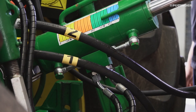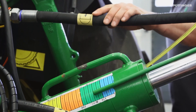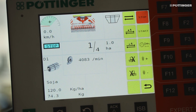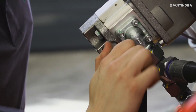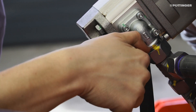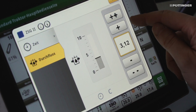To drive an Aerosem seed drill equipped with PCS, an additional control unit for driving the separation elements is required in addition to the fan. The fan speed is set to 4000 rpm using the tractor control terminal, or by manually adjusting a knurled screw. When adjusting the fan speed, the knurled screw on the fan can be turned all the way in, if the spool valve is equipped to control the hydraulic oil flow rate, to avoid the oil circuit heating up unnecessarily. The flow rate to drive the PCS elements should be 2–4% higher than the fan spool valve to ensure a continuous supply.